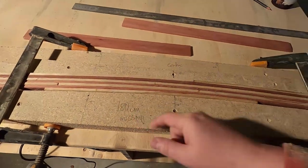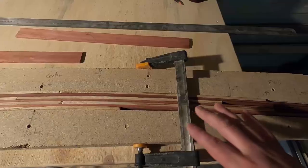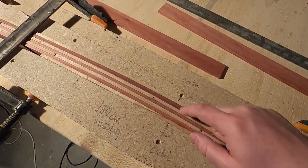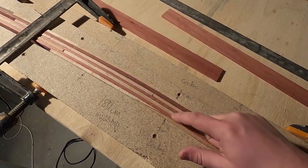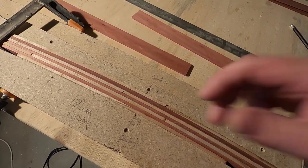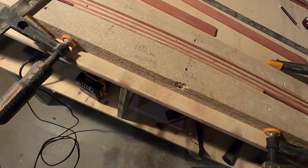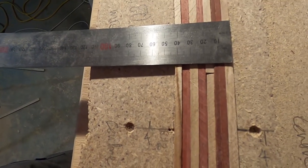I have 180 centimeters missing of this stuff so I'll have to chop up a little more. I've got enough Jarrah for 3 layers and enough of the chopping board wood for 4 layers, giving 7 layers in total. Seven times 5 is 35, but the strips are slightly thicker - it's almost 45 already. I reckon with all the glue and everything, that'll bring it up to 45. And it doesn't have to be exactly 45 anyway - that's just sort of arbitrary. Should be good.